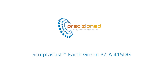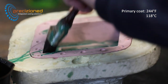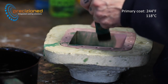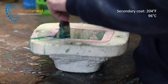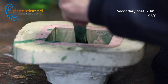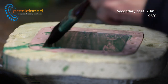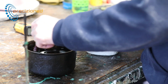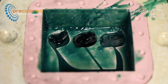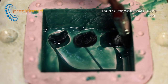Green is the second option in the Earth range, offering a choice dependent on your colour preference. This mould has deep, smooth voids and no back, so the wax is built up layer by layer until the desired wall thickness is reached. Liquid wax is poured into the lettering in the mould. A little heat is applied to ensure the wax runs into the deep void created by the lettering. The craftsman now applies further coats at lower temperatures to build the walls, making use of the slower setup rate of the Earth wax to ensure complete coverage.